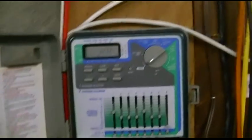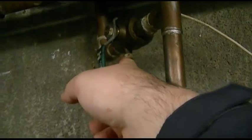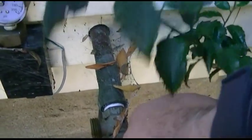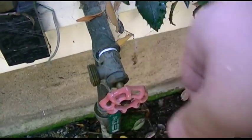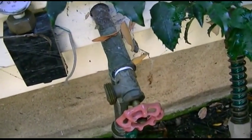But before we do that, we need to shut the water off, and that is right over here. So we shut that handle. Now that's a drain cock there, and we're going to use that in a second. But we have to go outside and open up the valve out there. This is the spigot that I have attached to the water line for the sprinklers — I'm going to open that up. Now I've shut the water off inside, so it's just dribbling out whatever residual water. And now we're going to go open the drain cock inside.